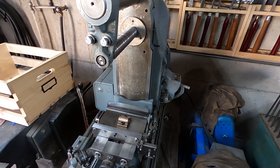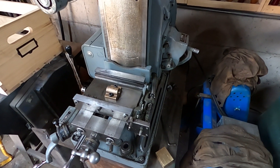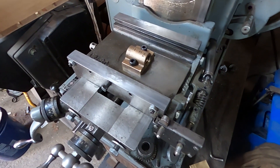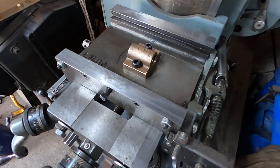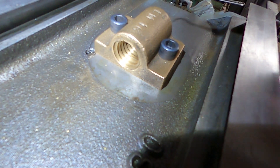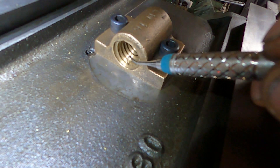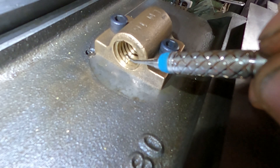We're starting in the middle of a project here. This is my Industrialite F300 horizontal milling machine, and it needs a new crossfeed nut because this one is just worn out until there's nothing left of it. Inside, the threads themselves used to be an acme thread trapezoidal, and now they are just sharp little spikes of their former selves.